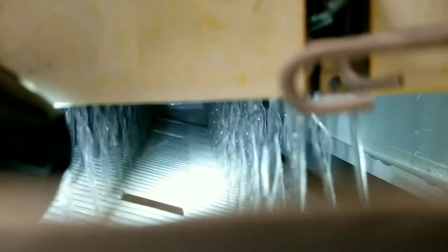Okay, the ice did clear in the back. Alright, that's good. But see those holes? That's where the plastic's missing. It can hold the ice. I don't like that. And that section way in the back is cracked. You can see the line that runs right through the center. And it's cracked right at the end. So, I'm not liking that. We gotta get a new ice guide in there.